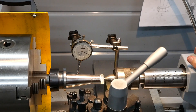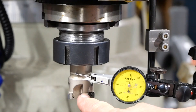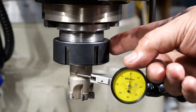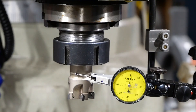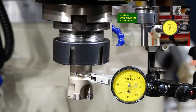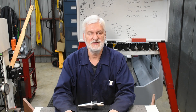I think it's time to call that done and take it over to the milling machine to see what happens. I've got my adapter back in the milling machine and I'm using the same end mill with a one inch shank that I used with the original testing. Unfortunately I can't use the same collet I was using in the lathe because that was for a 25mm diameter bar and this end mill has got a one inch shank — but such is life. As you can see we're getting an excellent result here. A run out of 0.003 millimeters, or a couple of tenths of a thou — that's pretty good.